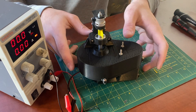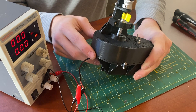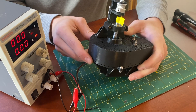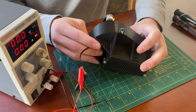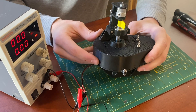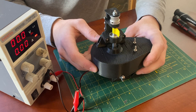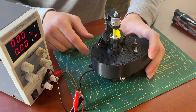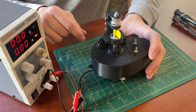I am now going to get the motor running. I added a little piece of electrical tape so you can see the shaft rotating. You'll hear a few noises — one is more constant and it's the noise of the gearbox from the input motor, and then you'll also hear the intermittent click of the limit switch when it is triggered every one quarter of a rotation. I will also put a slight load by holding on to the shaft and you should see the current draw increase.